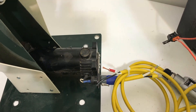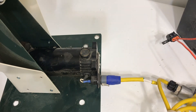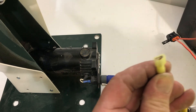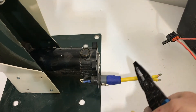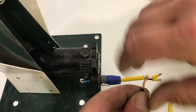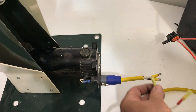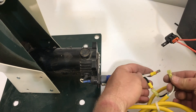First you set up the generator. We're going to put another female connector on it. Get one of these out and put it on the wire — twist the wire, make sure it's twisted. Don't put it in with it all pushed out, you have to twist it so it's nice and slender, then slide the connector on. Once again, crimp and squeeze real hard. Then we'll do the last one — this is the negative wire on the input side of the diode. Twist it, slide that on, and crimp it. Black goes to black, and the white goes to white — it's really the positive.